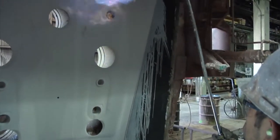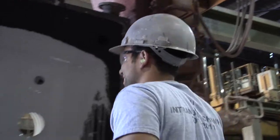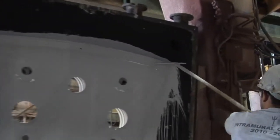This coat is then dried and the mold is sent to the bulk core setting where you can verify all the cores are in place, no excess wash, and the mold is clean of loose sand. An additional layer of refractory is sprayed on the mold before it goes through the closing process.